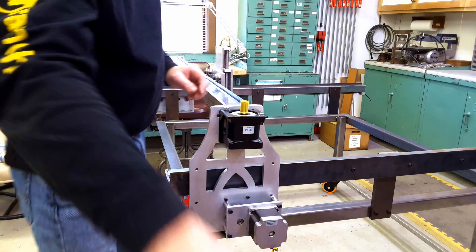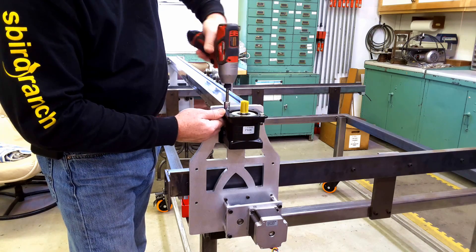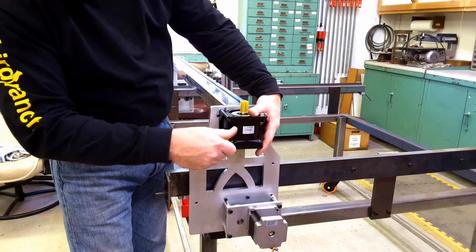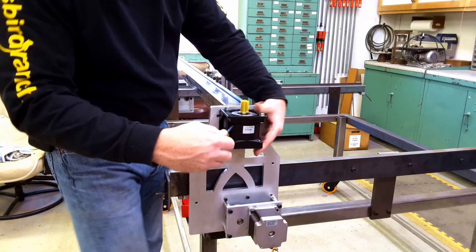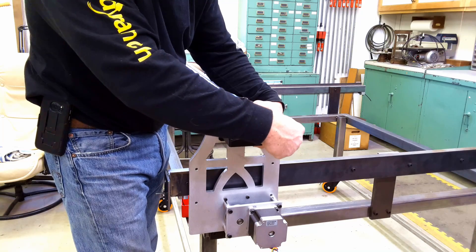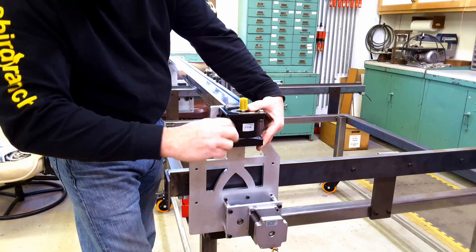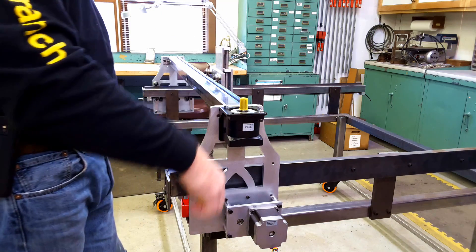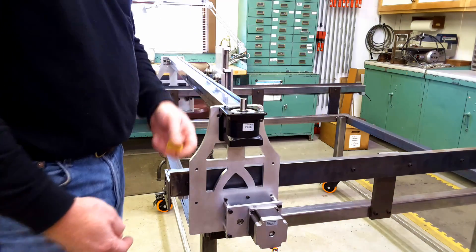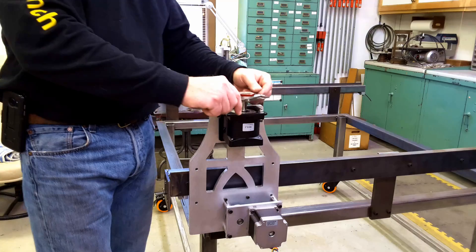Now that's a concern that as of yet is unfounded and it's something we can play with. At some point I can take this planetary gear unit out and see if a direct drive right off the stepper with the driver set to quarter step increments would be enough. I chose a planetary gear setup because it came in a nice neat package, but also because planetary gear setups like this have very, very little backlash. There's going to be more loss of accuracy in belt drive than there will be in this planetary gear.